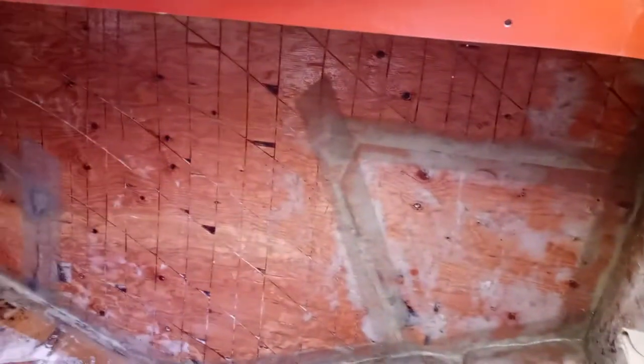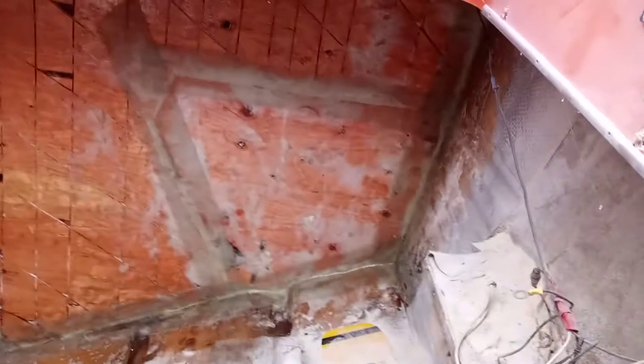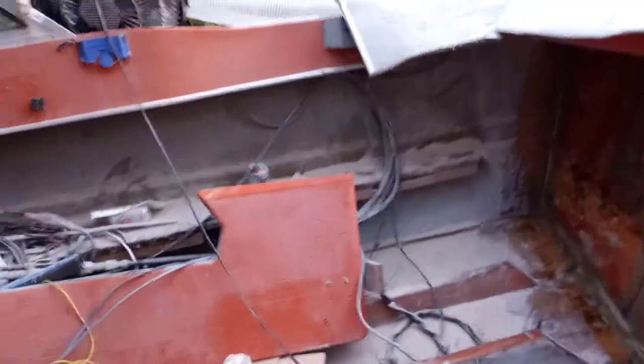So now it's just layups and stuff transom in, stuff peanut butter in, stuff transom in, peanut butter, layup, layup, layup, and that's done. Sister in those stringers, you can see where we cut them at 45 for more surface area when we tie in the back, and clean her out, and that's her. Thank God. It's been a long road to get here.